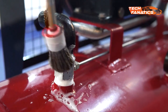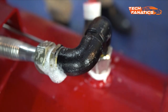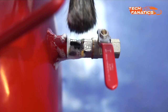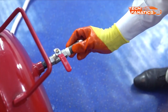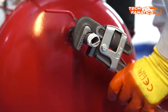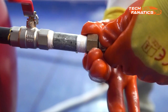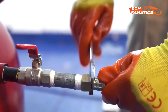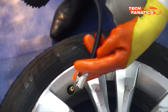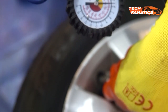If all the leakage points have been treated, again check all the joints with the soap solution. If there are no air bubbles anymore, we have successfully treated all the leakage points. The last fixing part is the hose pipe to the air outlet. To fix the hose pipe, we'll first screw a barrel nipple to the air outlet. We'll use a pipe wrench to tightly fix it. And then we'll fix the hose pipe to the other end of the barrel nipple. The hose pipe holds an air gun to fill air in the tire on the other end. Now this over here is a demonstration of a tire being filled using a Tech Fanatics air compressor.